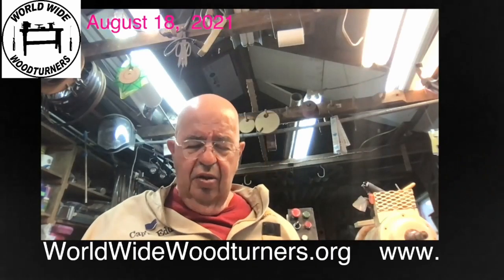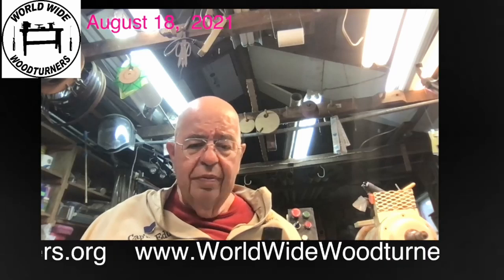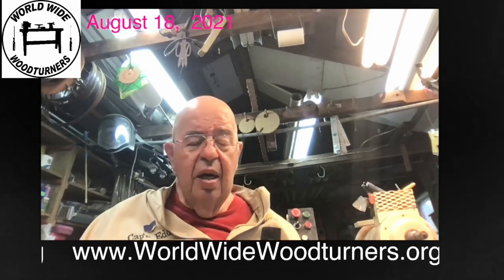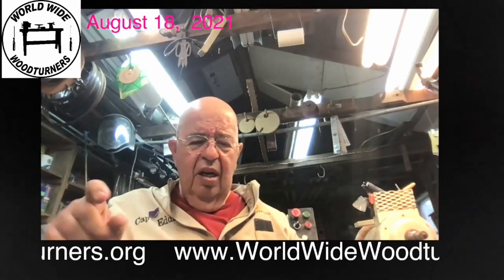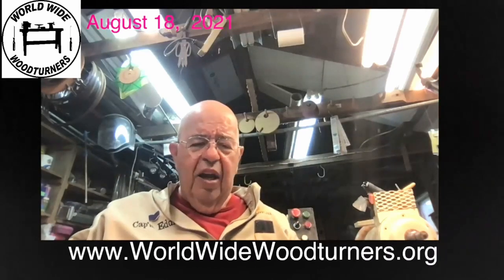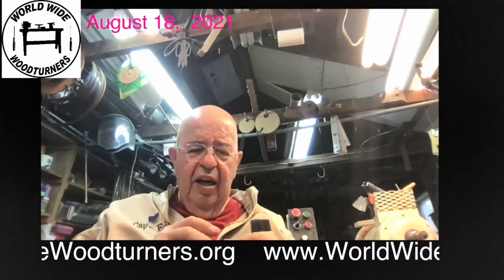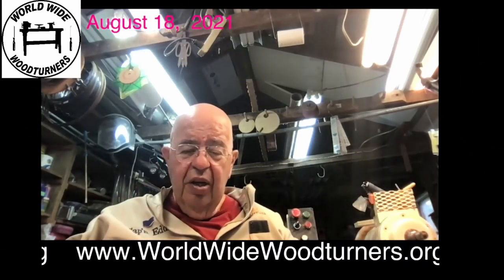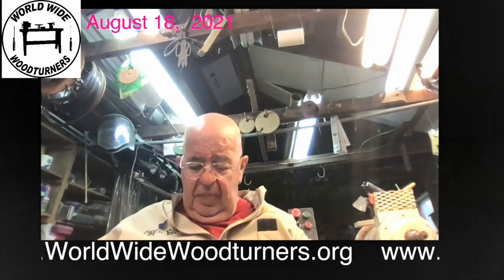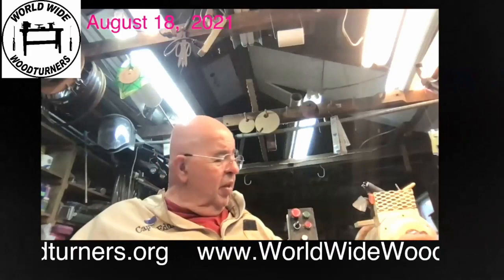And you know, if you turn anything soft, like a 2x4, and it's starting to separate, come apart or whatever, do the CA drip over. And it goes in so quick and is curing the second it hits the air. Do the light drip on it, let it get in there. Now here, if you wear glasses or you're wearing your face shield, give it a minute. Otherwise, you're going to spend a lot of time with acetone getting it off.